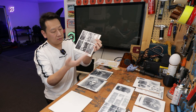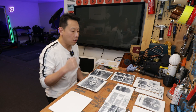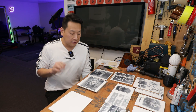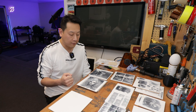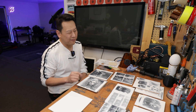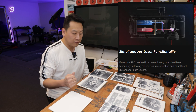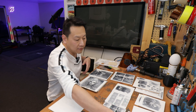You just keep doing it until you get the result you want. The thicker the spray, the more power you need. When you spray the mixture, it's very important to do that consistently as well. This is one of the reasons why I say this is not the perfect method yet — the perfect method should be something repeatable with good results. I'm still waiting for that, but this is a good start. The LaserPecker 4 has two wavelengths: 450 nanometer and 1064 nanometer, almost like infrared.